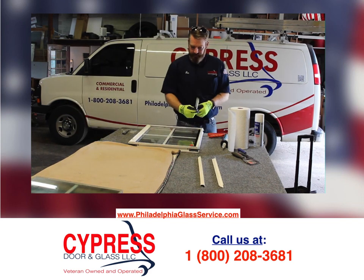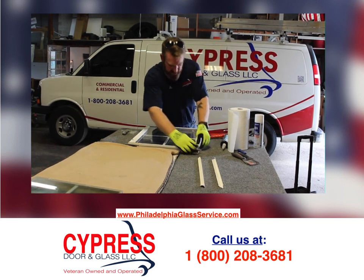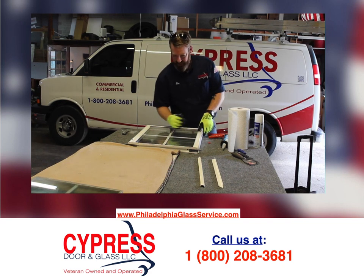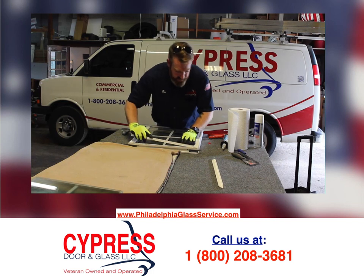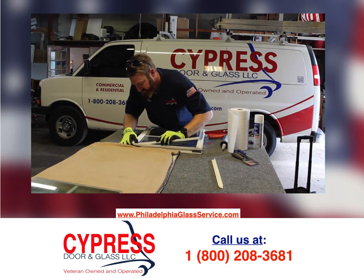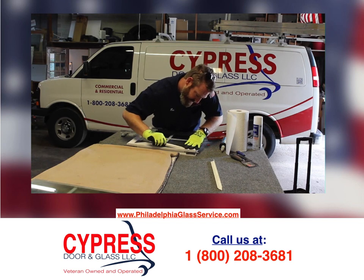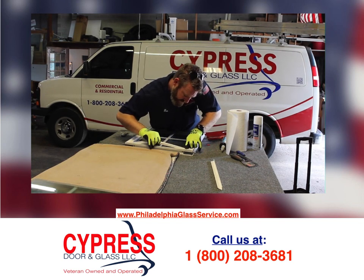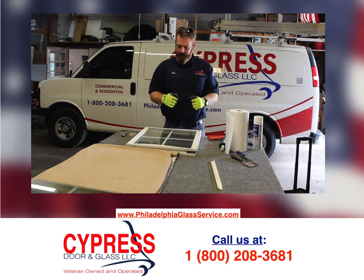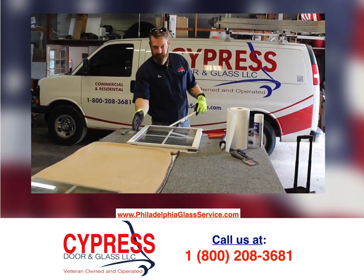That just snapped right in. We'll go to the other side now. These are going in fairly easy. Sometimes you have to hit them in — you can use the wood part of the hammer, don't use the head — and you can slide them in and tap them in. These things will definitely take a little bit of abuse, but not too much. We do this a lot around here, so we're kind of used to how much we can get away with. If your window is old, your vinyl might be brittle. You can kind of see if you're able to bend it. If it starts cracking, you're not going to be able to do this. You'll have to kind of work your way around and then you'll be left with one edge.